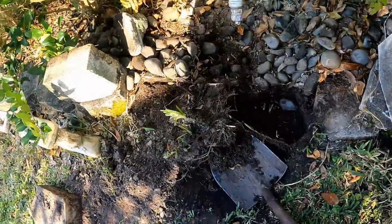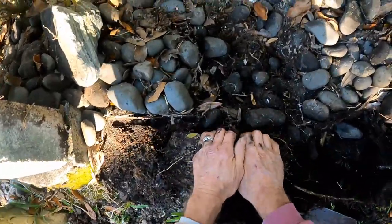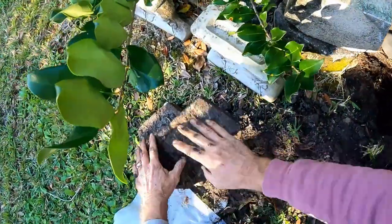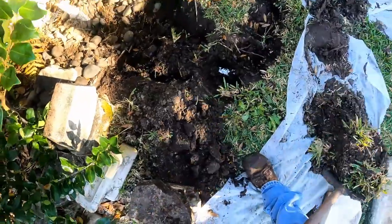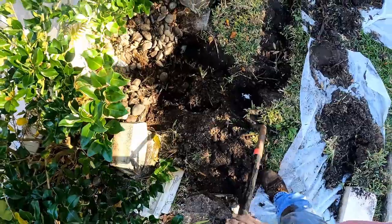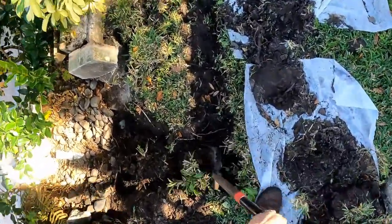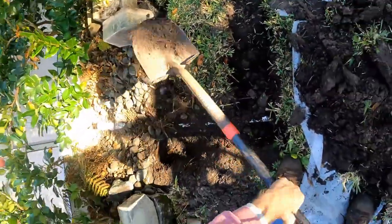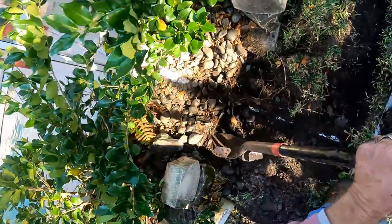At this point, it kind of dawned on me. I wonder if all the downspout drains are actually reducing and going to 2-inch as well. And if they are, we need to replace all of this. And sure enough, when I spoke to the homeowner, he said he ran 2-inch almost 200 feet from the downspouts and these catch basins out to the natural area behind the fence. So basically, we're going to reroute our entire system and replace everything here.